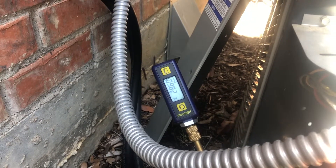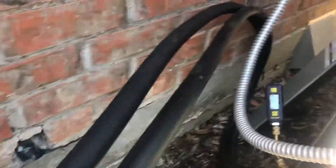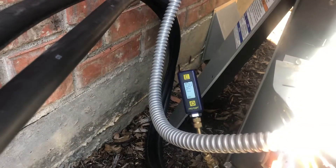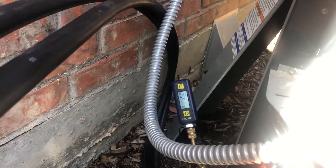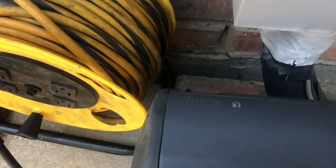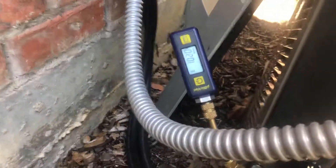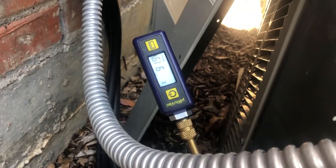You can see how fast it's pulling down - pretty quick. I'm going to leave my bypass open until I reach about 1500 microns to save my oil. We're just about there. Once I hit 1500 I'll go ahead and close this off - just a simple switch - and watch it go down the rest of the way. Already below a thousand.